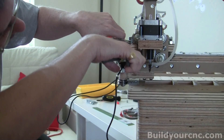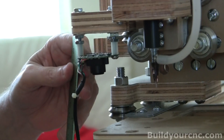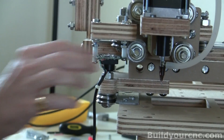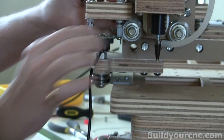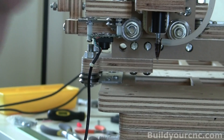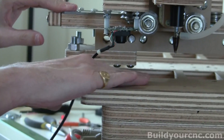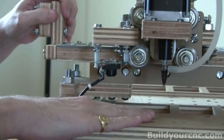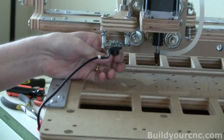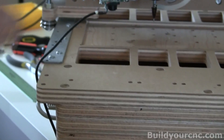Picking and placing will be off because all measurements are going to be measured from the camera location. I'm going to do another check on the measurement, do a slight tightening here — I don't want to go too much. This is really, really tight, so it's not going to move at all. Now we have the camera connected to the mechanism. The camera is not going to change level, so all movements will appear pretty focused. There will be multiple levels on this table — a level here and a level where the PCB will be. The focus on this camera has a range, and you want to make sure it's focused on both the pick level and the component level.